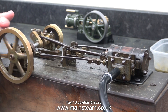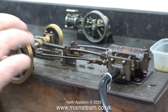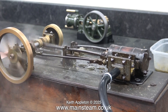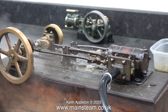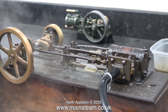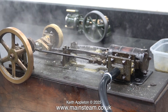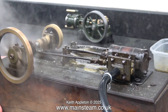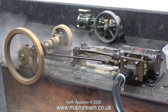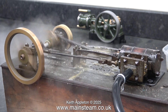Here, before opening the steam valve, I'm rotating the engine, then I gently open the steam valve. The first steam that hits the cylinder condenses to water and quite a lot of it squirts out of where the gland should be — no need for cylinder drains on this engine, it's got one built in. I've really enjoyed repairing this engine as sympathetically as possible, but I could not bring myself to make a proper gland for the steam cylinder because there was never one fitted in the first place — it's just a dummy nut soldered on. It's a bit reluctant to start but I haven't opened the steam valve very much, and as soon as the water clears from the cylinder it starts to run and it runs very well.